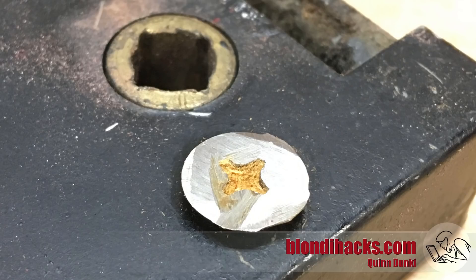Going back to the outside of the case, somebody has repaired this in the past. One of the screws goes through the entire enclosure and serves as an axle for one of the springs inside. Somebody has made this one out of an old wood screw or machine screw and ground the head flat trying to get it flush with the case, but as you can see they didn't quite get there. This is why the lock was so hard to remove from the door — it was dragging quite a bit. So we're gonna make this part and do a better job.